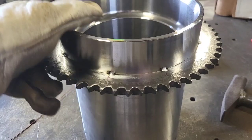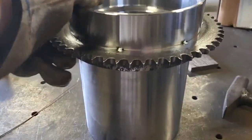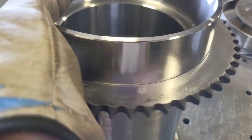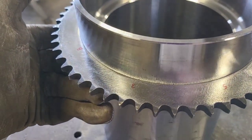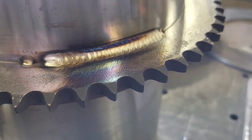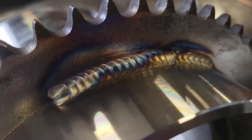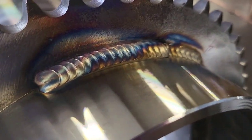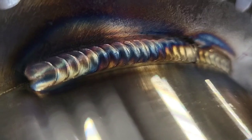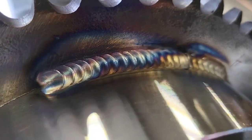When you're doing high precision welding like TIG welding on specialty parts with close tolerance, tacking should always be treated like a torquing sequence. Starting at 150 amps, I went up to 160 amps and tried a 3/32 rod. I found its happy spot at 175 amps — started at 150 and wasn't quite happy with that. The steps just weren't as consistent as I wanted, so I went up to 175 and I'm able to move at the pace I want and get the ripples just right.